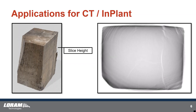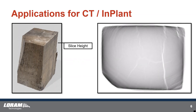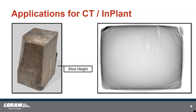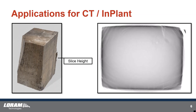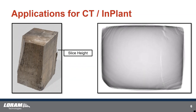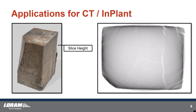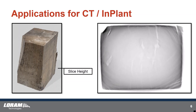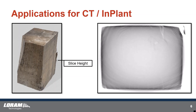We're also using our new system to start doing computed tomography. Here's a small one-foot section of tie cutout. We're now looking at whether we can assess ties before they're in track and get the initial state of tie health before they go in — that will help us with historical trending quite a bit. We're making three-dimensional reconstructions of the tie — computed tomography, also known as CT. You can string them together and they play like a movie. On the left you see an animation representing roughly where the height is on the right — each frame on the right is a slice at a different depth in the tie itself, flying through the center of the tie in three dimensions.